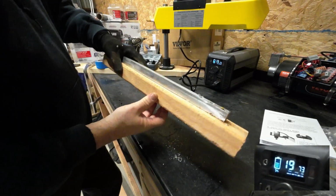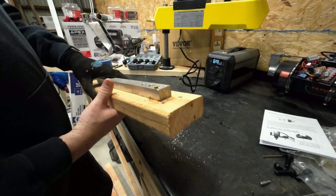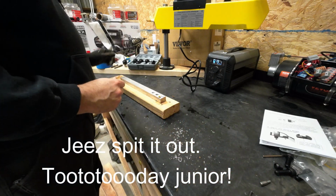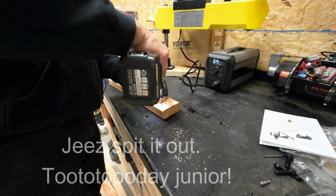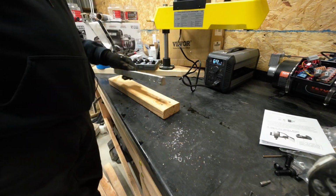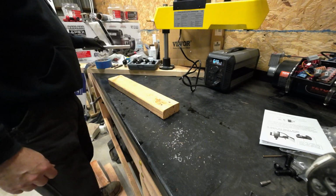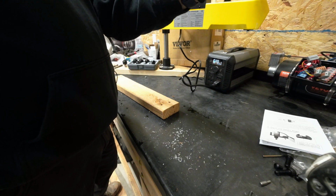Look how easy that was. How's it M12? I mean, just about like a 1/2 inch. It's on aluminum, so like I said before, it's not super tough metal, but also this is not just regular super thin aluminum. It's 3/4 inch thick, and it's MIC 6, so it's a bit more rigid, a bit more gummy of a metal. That did pretty good with the aluminum.